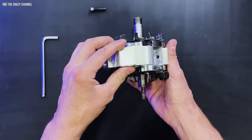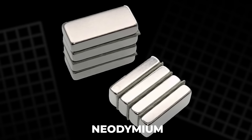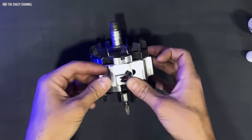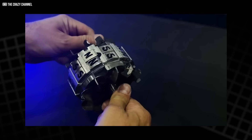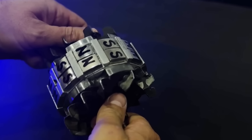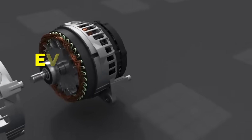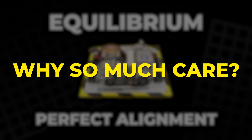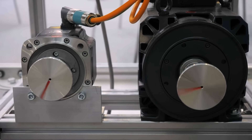This is where the real magic starts. We begin placing neodymium magnets — strong and sharp-edged — each one carefully oriented. The outward-facing side of each magnet is designated as north, lined up in the slots with painstaking precision. Opposite them, south-polarity magnets are inserted, forming a field of opposing forces locked into symmetrical balance. These magnets aren't just stuck on — they're bonded. High-strength adhesive holds them firm, resisting the high-speed rotation and vibration to come. Every placement is double-checked, because even the slightest misplacement would throw the rotor off balance.